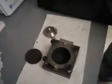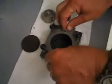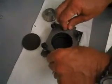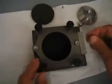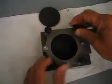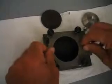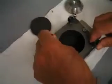We are now assembling the shear box and preparing the sample. The box has been rinsed and reassembled. The screws holding this all together are down nice and tight. We are going to back off a little bit on the gliding screws and make sure that this is appropriately tight. We are now ready to load the sand.